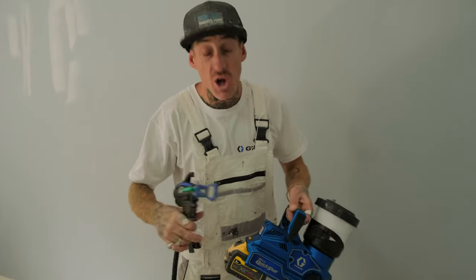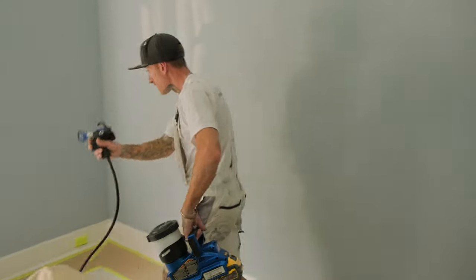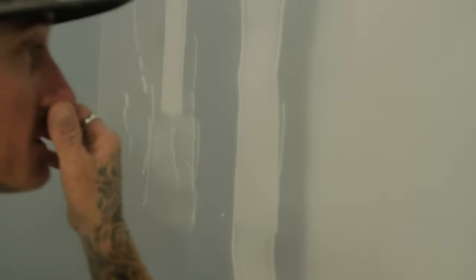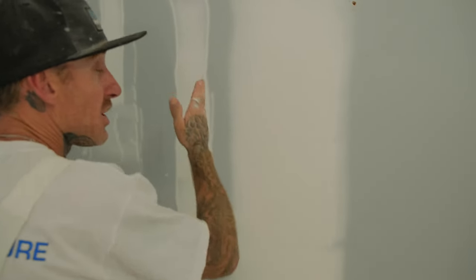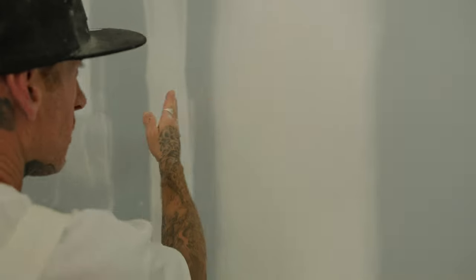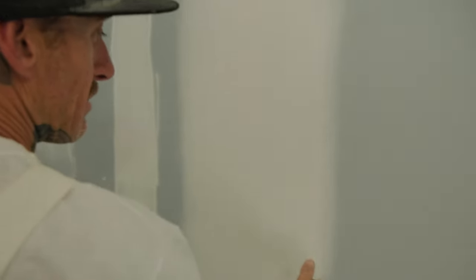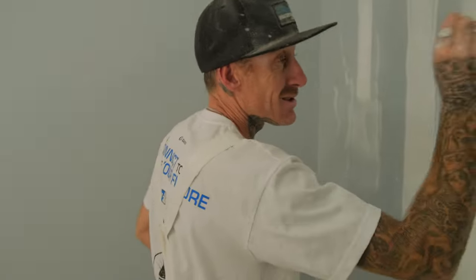The 308 — I'm so happy it runs perfectly through the Quick Shot. This is a tip I'll be using a lot of the time, spraying intricate woodwork without dragging leads through the house. You can just carry it around and spray all your woodwork. I'll show you the difference: when you've got nice atomization on each side, fading out without thick edges or a sharp edge, you know that's the right pressure for the application and machine you're using. Now we're going to put in the 408 and see how it sprays.